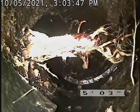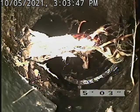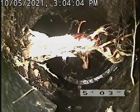We have a failed sewer line to the septic tank. We have a massive tree root which has grown through the joint, split the pipe, and actually started tearing the pipe apart. There's a break on the bottom of the pipe. Almost looks like that root is probably anywhere from like an inch to an inch and a quarter thick.